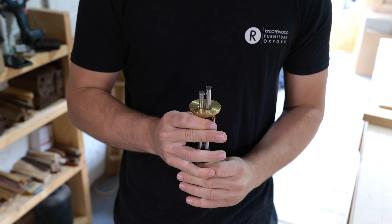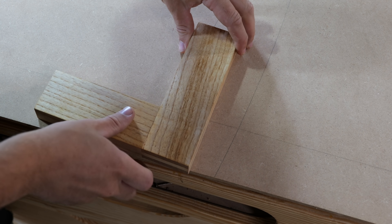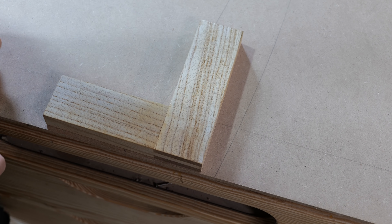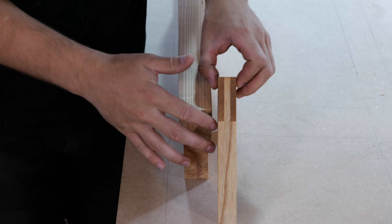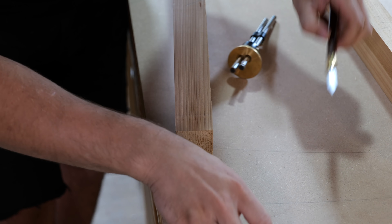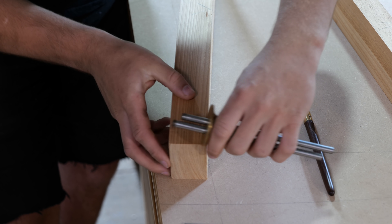What's important is that I cut out the correct parts of the bridle joint. With this design I want this line to continue down to the ground — I don't want a line that breaks up the flow of the design. With bridle joints generally you want the bit in the middle — the bridle — to be a third of the thickness or width of the entire joint. In this case it's a little weird because we've got two different thicknesses. I'm going to divide the thick one into three, giving me a larger tongue to fit into the cheeks. We'll use a knife and ruler to divide it into three, mark two points at the top, then use the mortise gauge referencing from the face edge to line up with those marks.